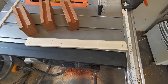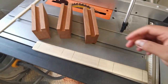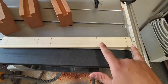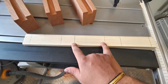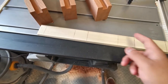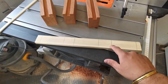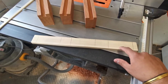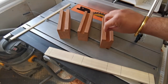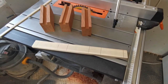Using a piece of poplar, I'm going to create three separate stop blocks which will fit within the grooves of each of the three jigs. I've marked the distance between the internal stop blocks, so they'll be cut into three separate pieces. I'll use the router to create a groove — almost like a keyhole — for each one, so they can slide within the actual jig itself.